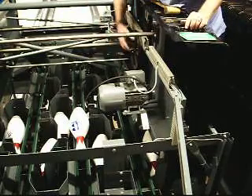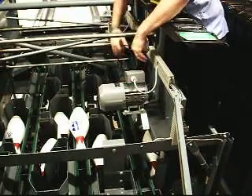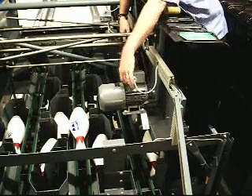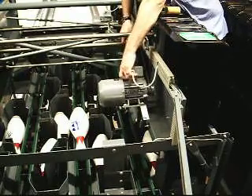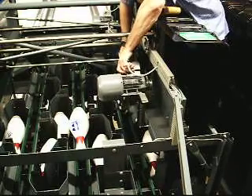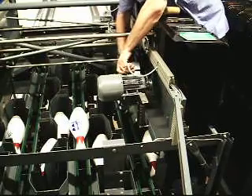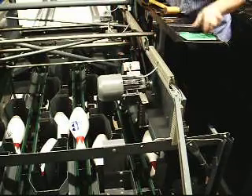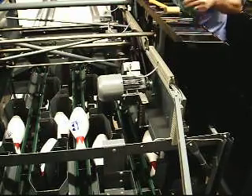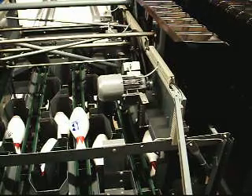Alright, I'm set up. Get this belt back on — got it on the small pulley wheel first. I'm going to tip the motor towards the front where the bowler stands, just enough to get the belt on. Don't over-stretch your spring on your table motor. I'm going to get my wrench out of the bottom, then start it and cycle it to see what happens. That should probably fix everything.